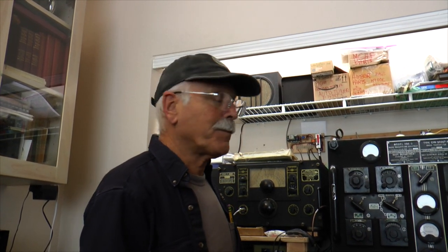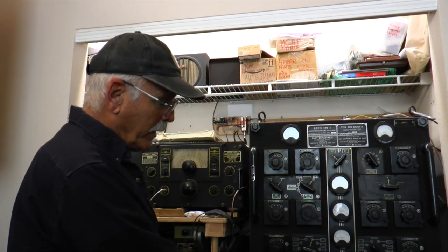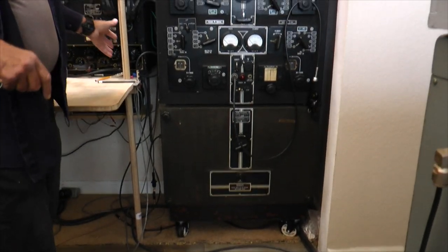So we loaded it all up, brought it here to Reno, out in the garage, and did a complete tear down. The motor generator set was first. It was a long story finding the best way to do quiet three-phase, no solid state variable frequency drives. But we got that done, and I'll show you what the typical startup sequence is. Normally the motor generator sits out in the laundry room. Way too noisy in the shack. Earphones only is the only way.